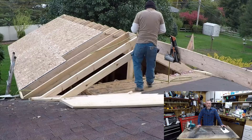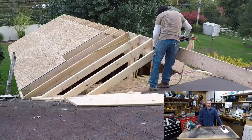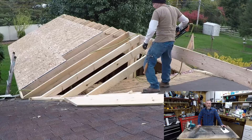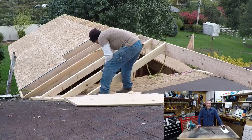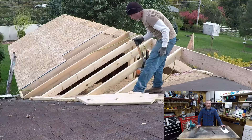Back nail them up top and use your hammer to drive them in where the compressor won't set them — I had a bad regulator on there. Nail the top, then toenail the bottom in. Just keep running them all out, just like regular rafters. They're all 16 on center — it's just an extension of the layout from the gable wall.